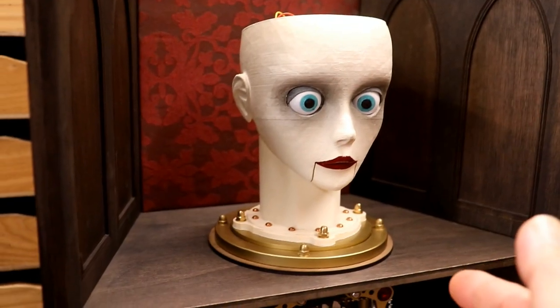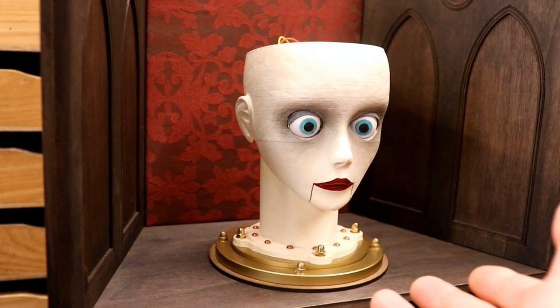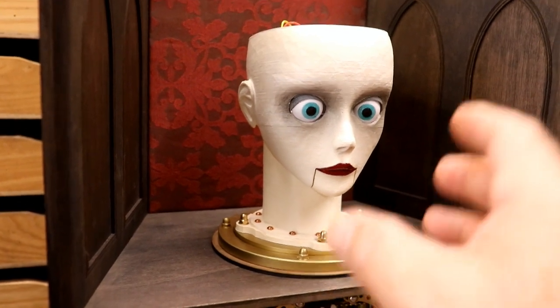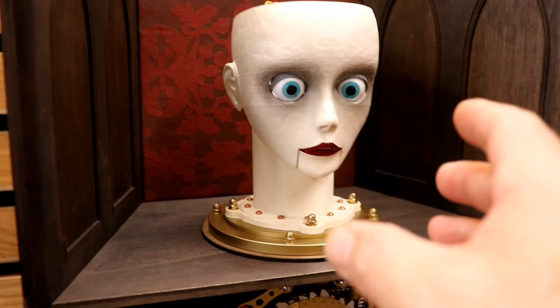So I have got to, as it turns out, introduce a switch, an electronic switch, Darlington pair or whatever, to switch all the servo motors on once the Teensy is properly powered up and is producing all the signals necessary for them. Otherwise she is going to get ruined. I think that's going to be enough for another video.